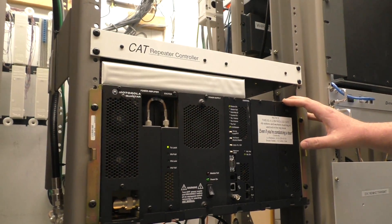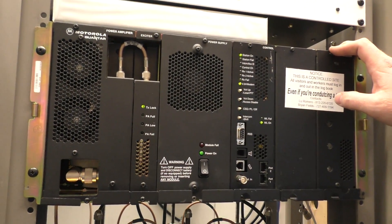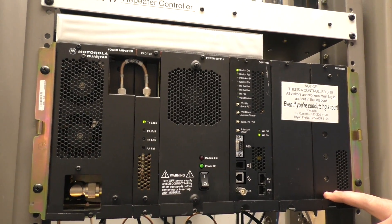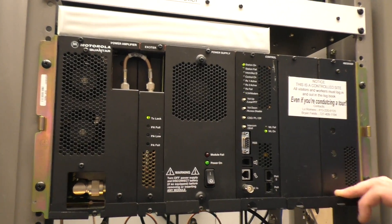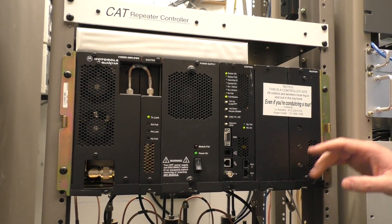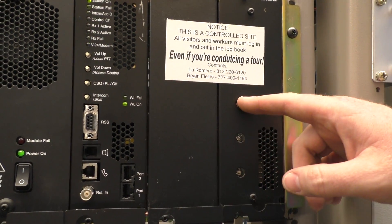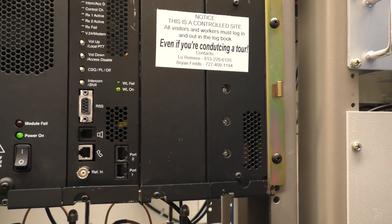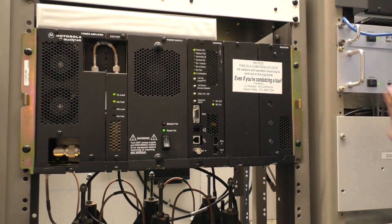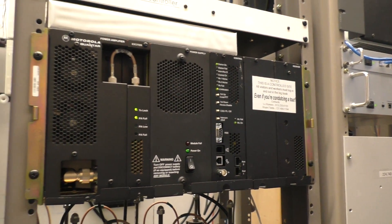Scrolling up, we have the Motorola Quantar Repeater. This is about a $15,000 repeater when it was brand new — it might be slightly overbuilt. We bought it as a $2,000 expense, which is a little bit more, but it came wired and tested with a warranty on it. What's neat about it, the receiver has a built-in pre-selector. This is a 4 MHz wide bandpass filter for the ham radio band. It's aligned and set up so that at 150 MHz it has about a 24 dB rejection, which is very important at a busy site like this.